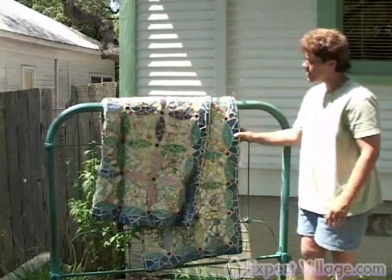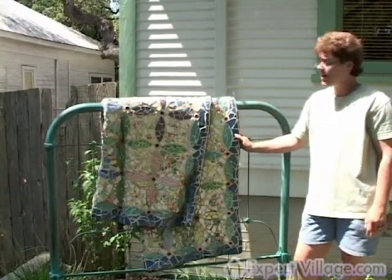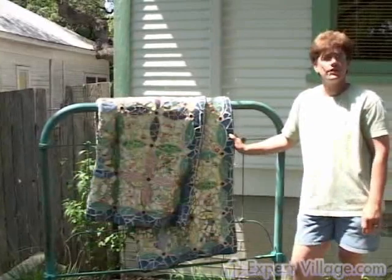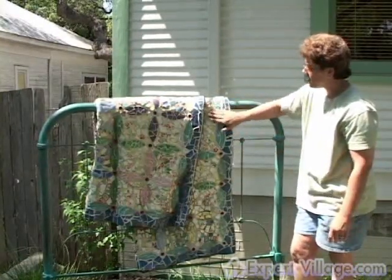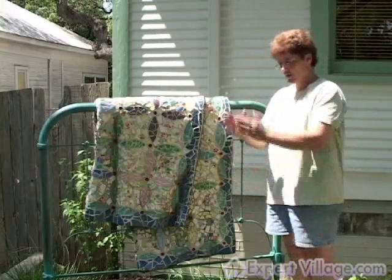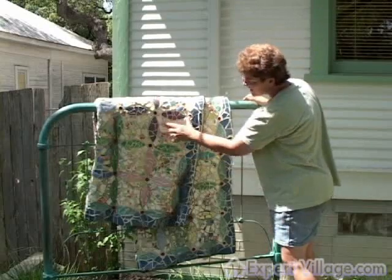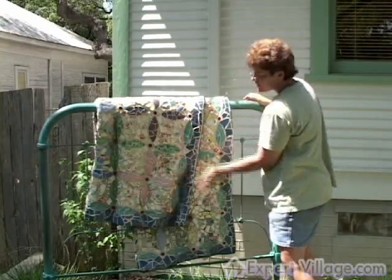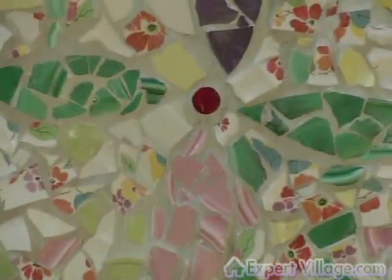After I put a couple of layers on, I put the mosaic tile on using thinset mortar for exterior use. I had my patterns laid out on fiberglass mesh, already pre-cut out. Each one is a separate piece but acts as one. I laid it all out, thinset it in, and cemented it in — that's how I created it.